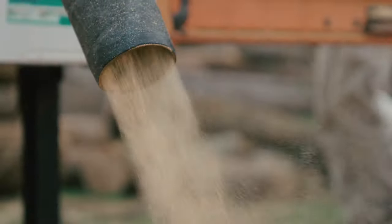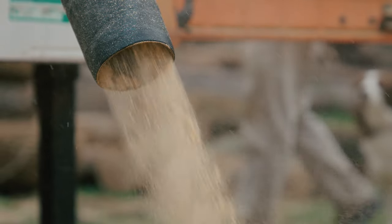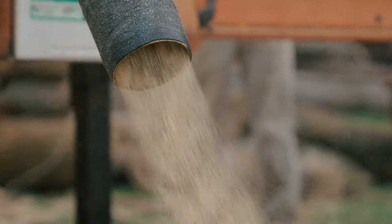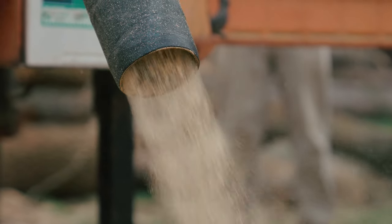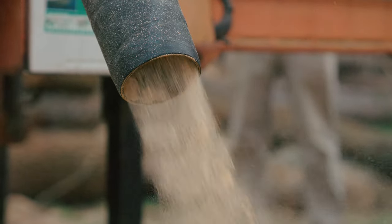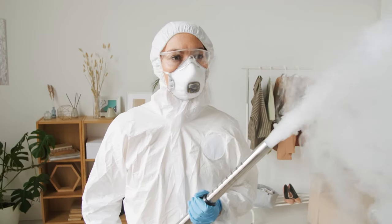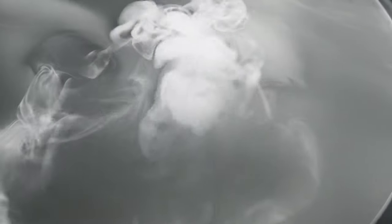Rough metal tubes could create fines and, in our case, cause sticky resin to coat the pipe, creating agglomeration and accumulation of particles. The next challenge is particle velocity. We must get particles to travel along the pipe and interact with each other to charge. We found it impractical to have particles free fall within the tube because the pipe inlet would be too high, bringing us back to the initial issue with pipe length. The solution is to accelerate the particles using some sort of compressed gas. Given the influence of moisture on the ability of particles to charge, we'll discuss this later.